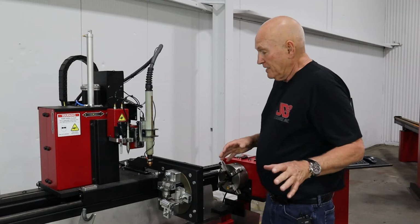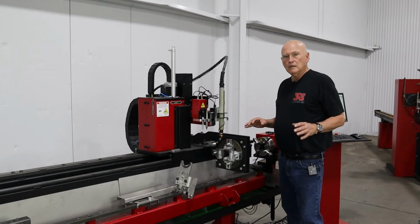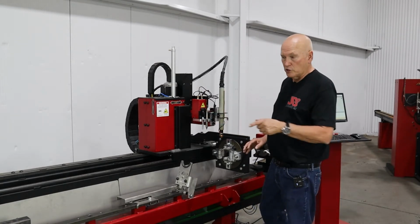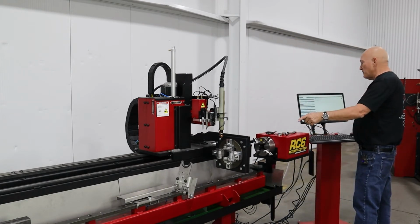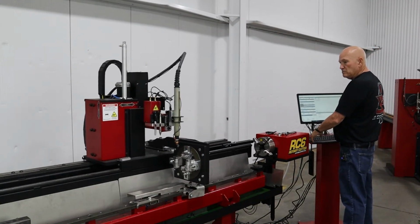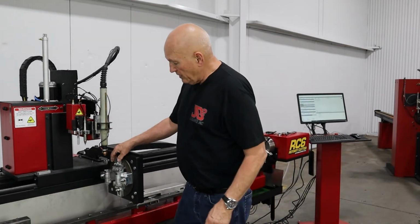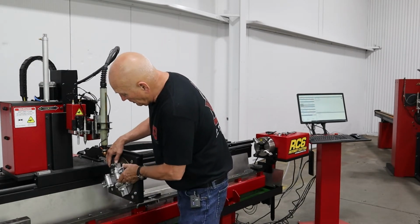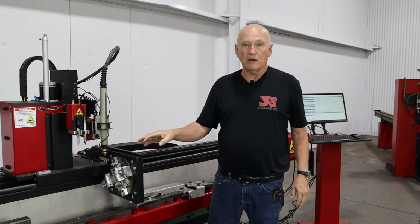Fairly simple. All right, let me get my tubing. We're going to load it up, and then we're going to cut it. I want to move the carriage a little bit further away from the chuck to load up our sample piece. First thing I need to do is drop the lifter. That's the subject of another video. Now I can move the carriage down. Alrighty. At this point, we're going to take the 2 yokes that we had marked, and move them both to the lower position so that the rollers form a V so that we can lay our tubing in it.